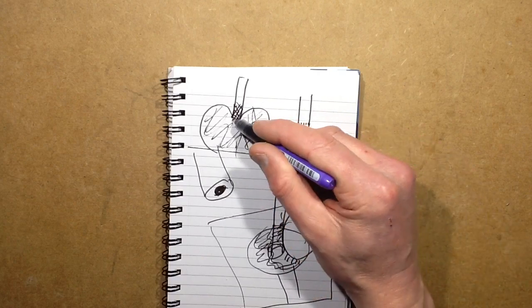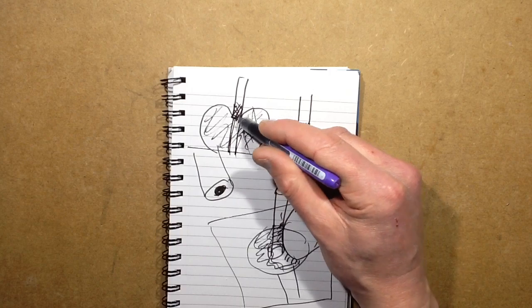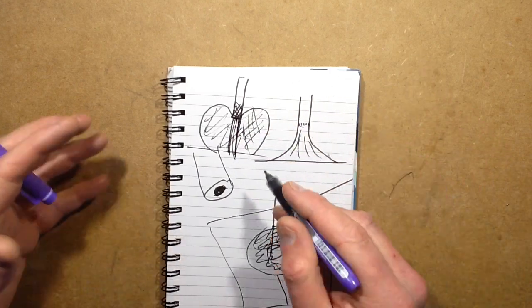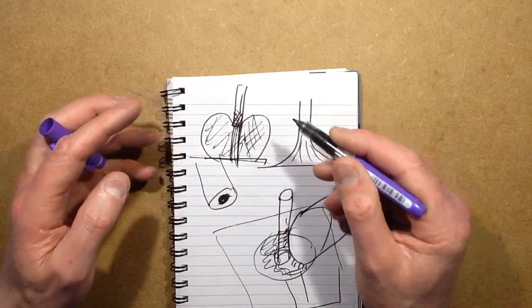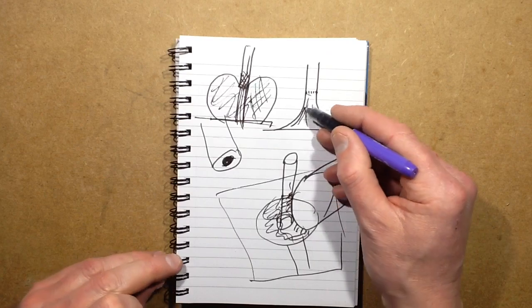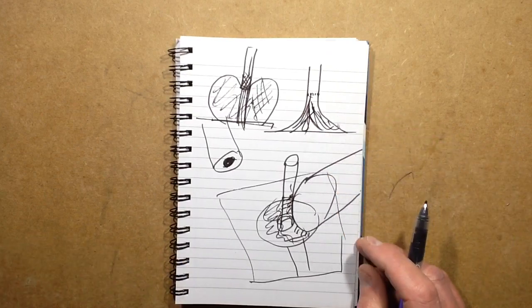But when that happens, it's possible for the lead to be passing right through that big ball of solder without actually making a connection. It can lead to electronic problems. It can lead to just physically no connection between the pad and the lead. And it's very hard to see that. So you're looking for that perfect wicking, sort of little volcano-y type effect.